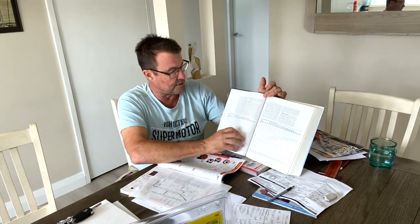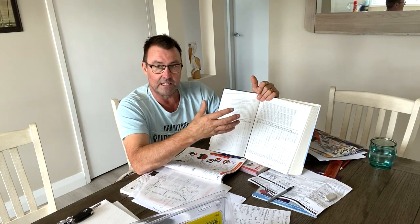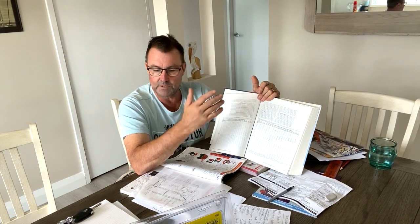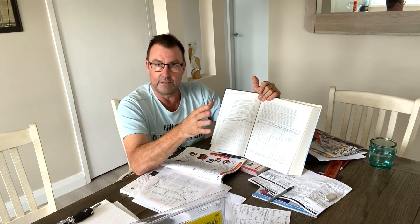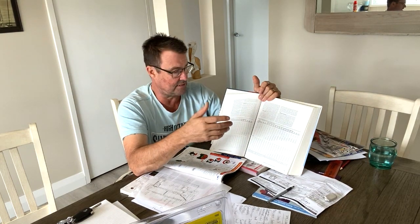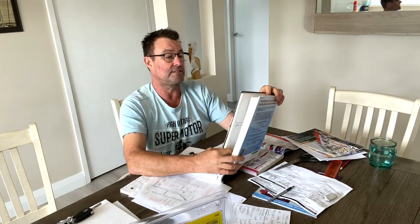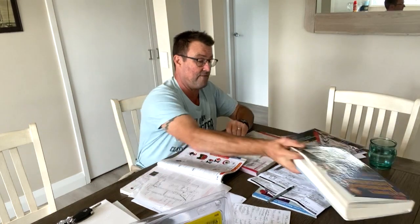Another great resource is Nigel Calder. If you haven't heard of him, make yourself aware of his book — it's got everything in it. What I'm looking at right now is cable runs and voltage drop, which you can learn from that YouTube channel or this book. For me, I just want to know: what's my total current on a certain cable? Is the wire capable of handling it? What fuse size do I need? Whether I'm happy with a 10% voltage drop or need 3% for something more sensitive — it's all in there. As it says on the book, it should come as standard equipment with every boat.